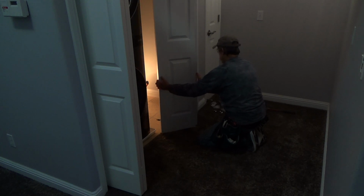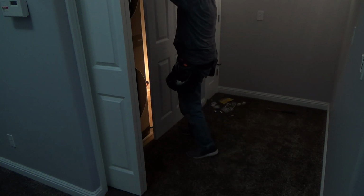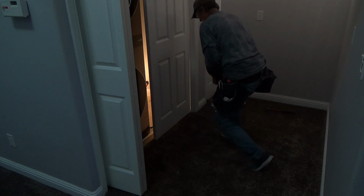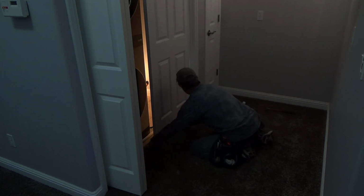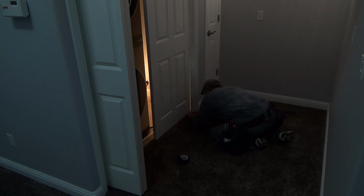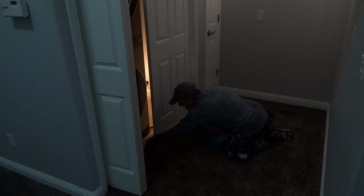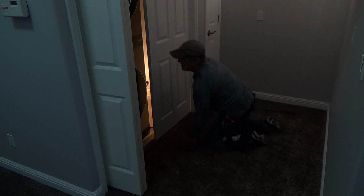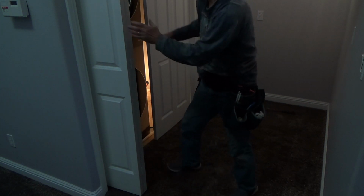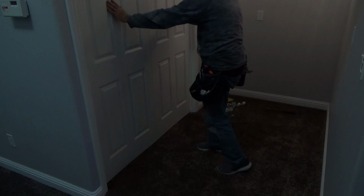Now I don't know that the bottom is exactly where it needs to be until I measure it. And 29 1/8 there. I think it has to be pushed in a little bit. I got 29 3/8. I lift up on it and slide it over. Making sure I'm in my groove, which I am. Lift up, strong fingers, swivel over, measure 29 1/8. You go through the whole process again, and that looks good.